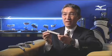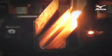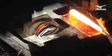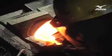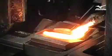This is a billet, a bar of steel. We use 1025 or 1025E. We heat this to really high temperature and go through the process of stretching and bending. We get a nice flow of the grains — just bend and squeeze — and then we put this in the primary forging mold to make this shape.